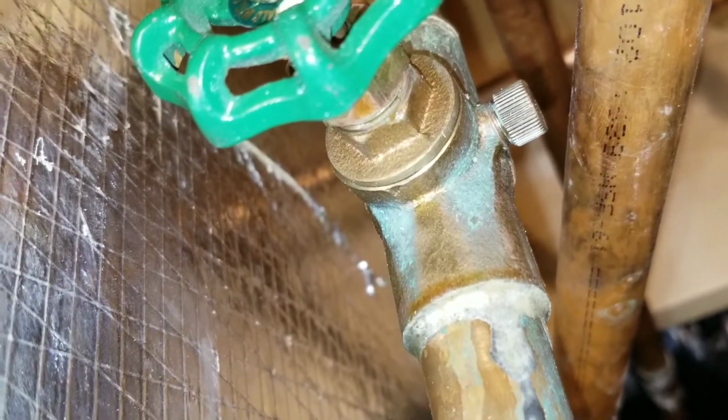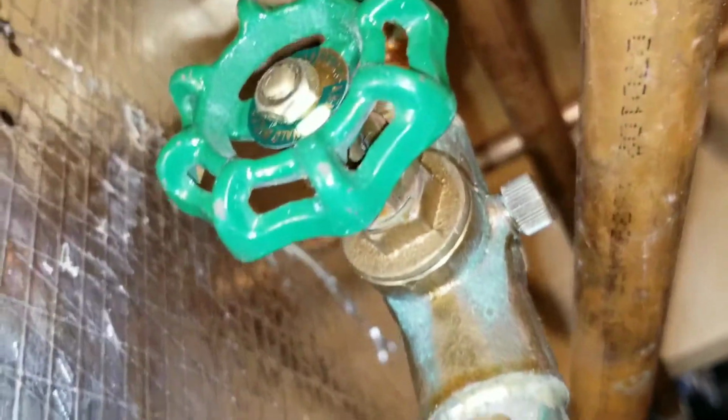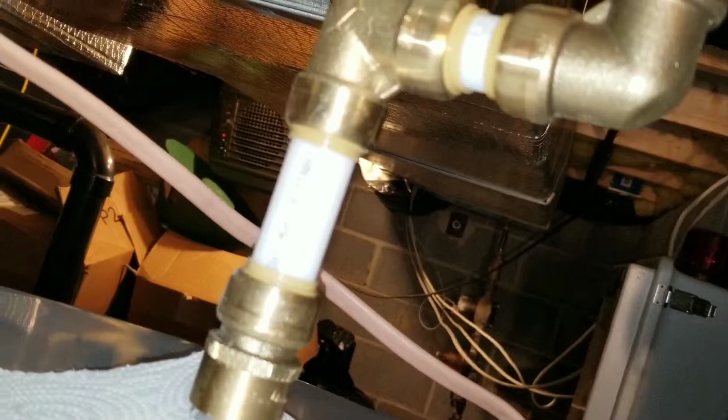Back to restoring the water. We want to let this water run so that it fills the hot water heater up completely, and also so that it disperses all the air in the pipes. And again, once you hear the gurgling or all the spitting stop from your faucets, then you can turn it off. You'll know that everything is full. Once again, here are all my fittings. Everything is nice and dry. And let's move on to the next step.